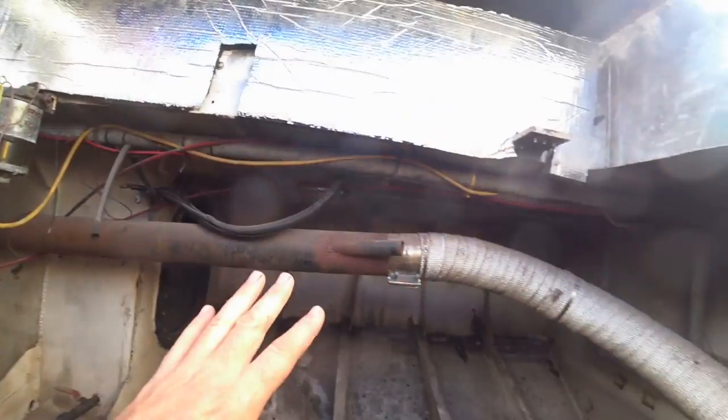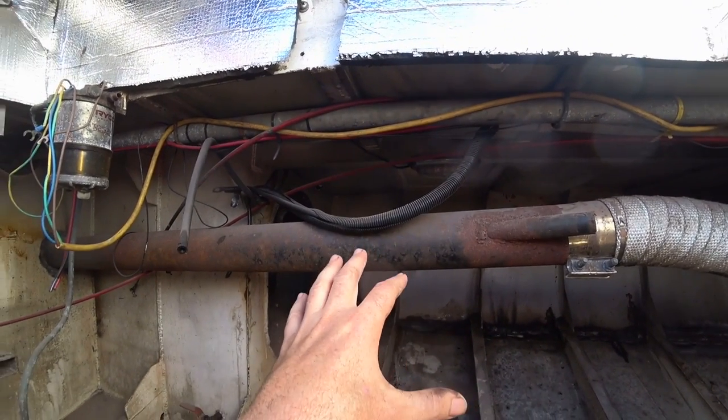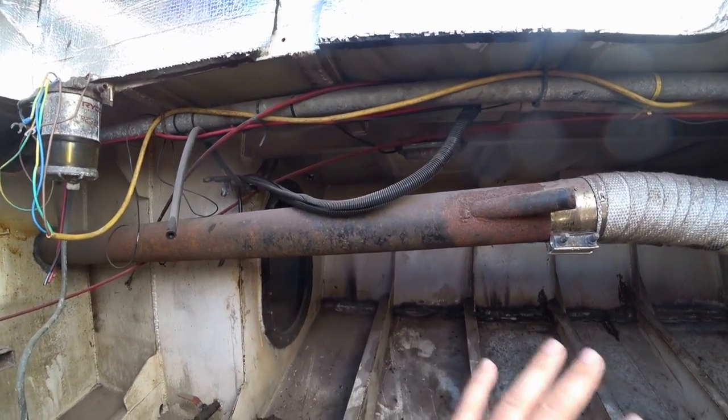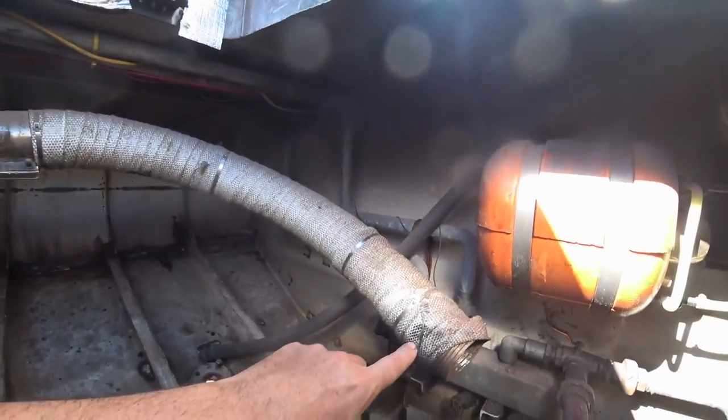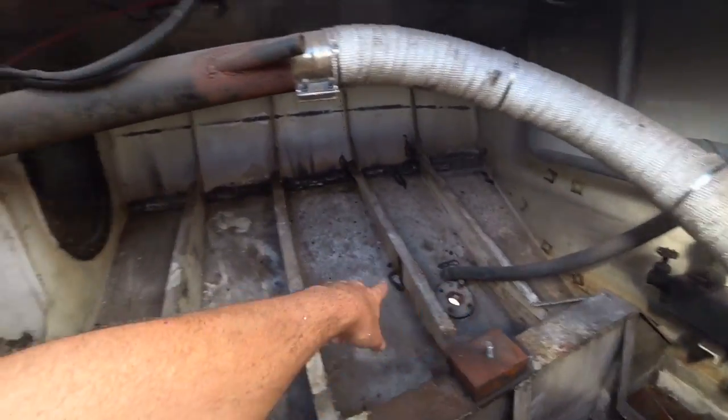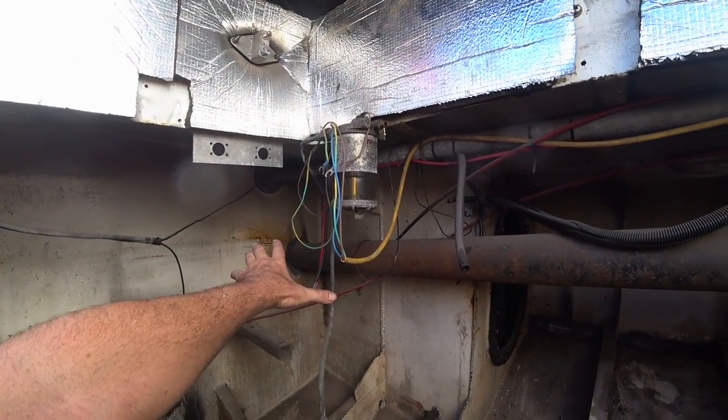It's all heat-shielded until the water is injected, then it's fine after that. The cooling water comes in through here and goes straight out through there. It's worth saying that the way this boat is set up is actually quite unusual — it's a product of having been converted from a dry exhaust to a wet exhaust. The raw water pump that goes through the heat exchanger to cool the motor can fail, and if you start the boat and see water coming out the exhaust you might think everything's fine — but all you're seeing is water from the one pump that does nothing other than cool the exhaust. So you can't take water coming out the exhaust as gospel that water is going through the heat exchanger. And getting rid of that wet exhaust pipe would give me access to the port side of the motor for maintenance and to reach the seacocks — a huge advantage from a space point of view.